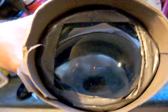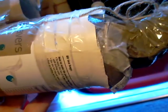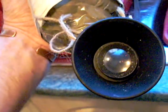Now, that's sensible. If you have any car boot sales near where you are, or old shops that sell things like old lenses that might have been used for something else, think about how you could adapt them for astronomy. For instance, I found this old lens here, okay, which is nearly 70 millimeters. And what I did is found it in a very, very heavy steel casing. I took the steel casing off, put the lens in. I used an old foam bath plastic tube, okay. Then at the back of it, I cut the foam tube at the end. I put a binocular prism at that end, and then an ordinary binocular eyepiece with an eye cup on the end. So basically, I've got a very, very clear view.